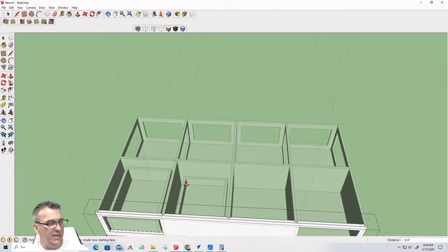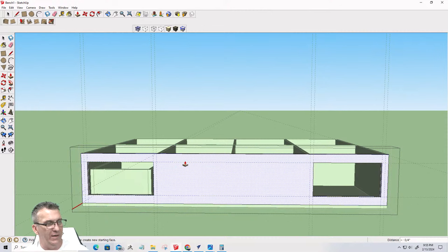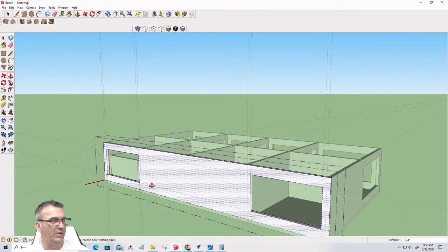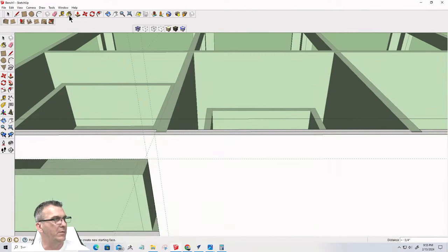Now, on here, my upper drawer is going to have a little bit more clearance than my lower drawer, right? I could decide to divide the drawers within that 1/8 inch space, but I want to put a 3/8 inch kind of clearance in between. And then that just gives me, on my upper drawer, a little bit more headroom if I need it for larger tools or whatever. And then here, just rinse and repeat.